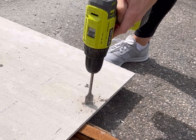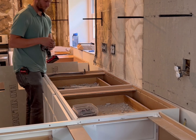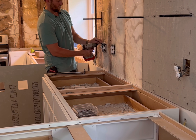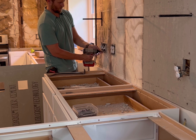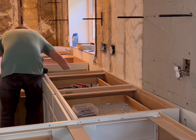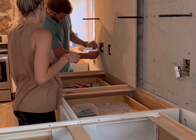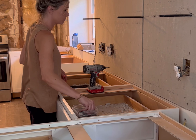This process was a bit tedious just making sure that all of our measurements were correct. We then unscrewed all of the light switches as well as outlets so that we could pull them through the cement board. We then slid the cement board into place and attached it to the studs using decking screws. The reason we use decking screws is because they are stronger than drywall screws and they're definitely more resistant to moisture.